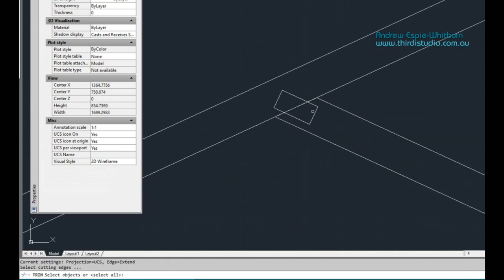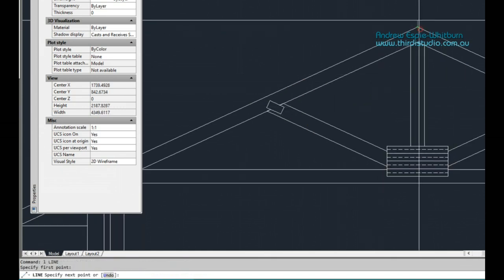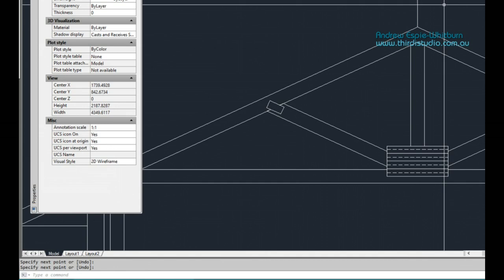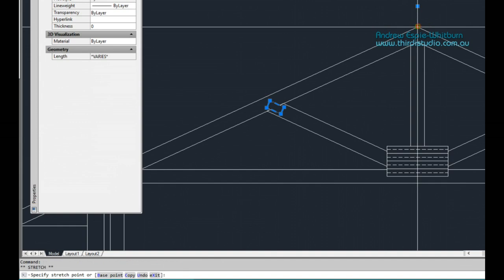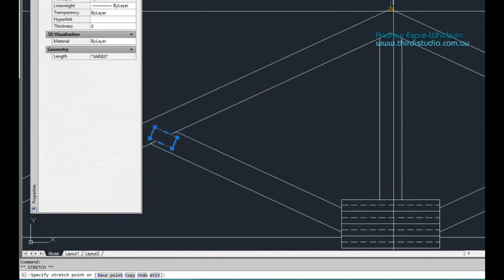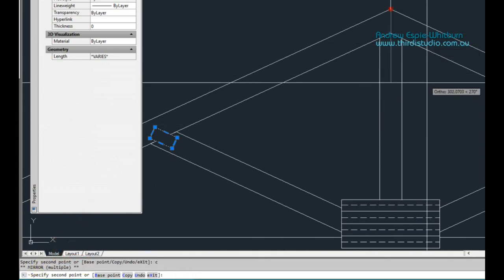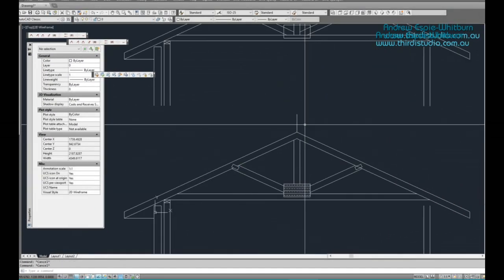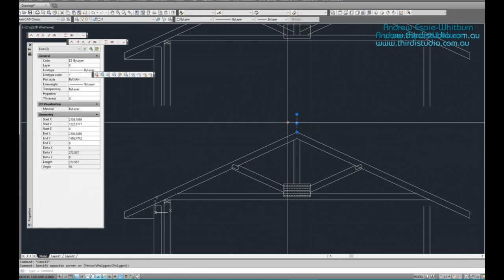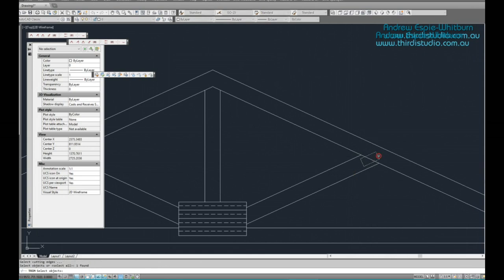and we can trim that, so TR for trim, and I'm going to draw a line from the tip up, doesn't matter where you go, just click somewhere, I'm going to select that, going to select the nail plate, I'm going to click there on that point on the tip of the truss, and I'm going to press space bar, space bar, space bar, space bar, and as you can see we're now in mirror, and I'm going to say C for copy, make sure the ortho's on, and I move my mouse down and left click, and now I can just escape out, select that, type E for erase, and now I can trim, so TR for trim,